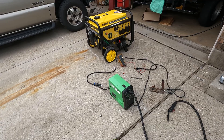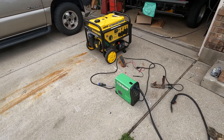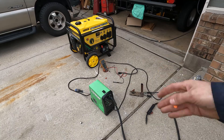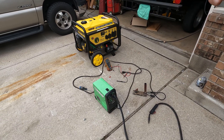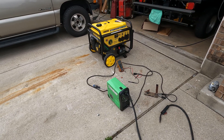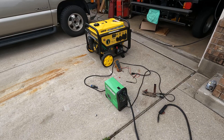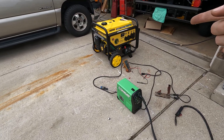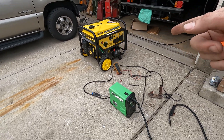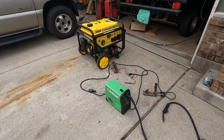But this is more of a proof of concept, and as y'all saw it worked perfectly. I would have no qualms about taking this thing out to the middle of nowhere and welding a bunch of stuff with it — it actually worked better than I thought. On the next video we're going to try stick welding, TIG welding, maybe plasma cutting, and just do a bunch of fab work. I will say this though: if you're going to do a lot of fab work with a generator, be careful not to overheat or overload it — you don't want to damage the stator. Be aware of your duty cycle.